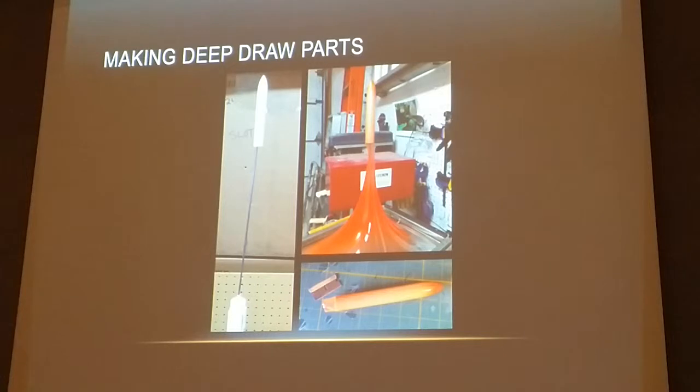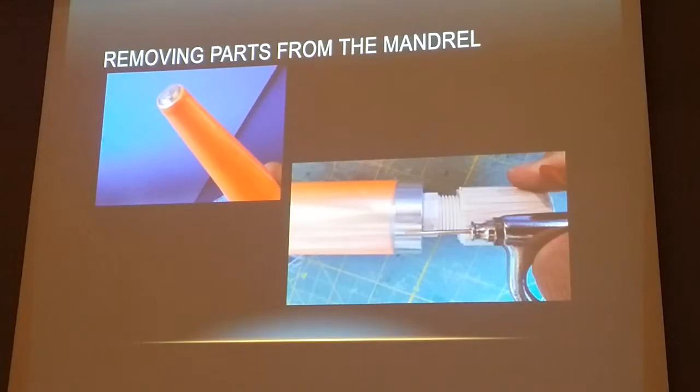It takes about four minutes to make a part, and the plastic is between $1 and $2.50 a sheet, so it's not very expensive to build. The big trick is getting the part off the mandrel, and it can be really, really hard. What we ended up finding was compressed air is probably the best way to do it. On the S1 part, I cut the top off and then use compressed air to blow the part off the mandrel. The key is it sticks air-tight — you have to get air between the mandrel and the plastic and lift it off the surface.